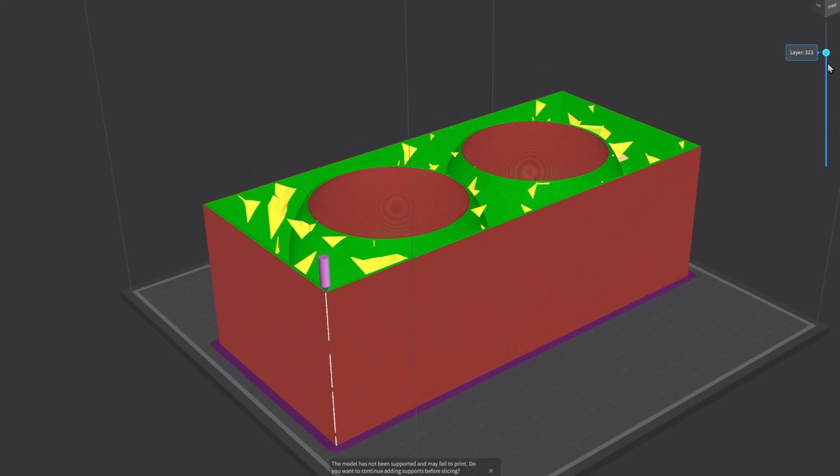I ended up replacing that material on the top with some memory foam - I cut some bits of that up, put it in the top there and it made it sound a lot better. Some key takeaways: next time I would use a different 3D printing software that lets you vary the infill on different levels, so I would print the baffle where the 4-inch driver connects at about 60% infill to make it really solid, then leave the top hollow with the gap filler. Also for this top piece with the four drivers, I'd probably try to incorporate some sphere-shaped enclosures like I did on my other soundbar because that made it sound really good. If you enjoyed this video don't forget to hit that like and subscribe button - I've got plenty more videos coming up. If you've got any other ideas for projects or questions please comment below. Thanks for watching, until next time, keep creating.